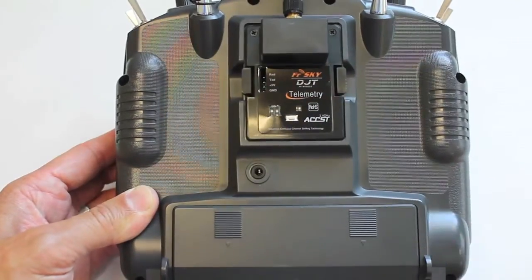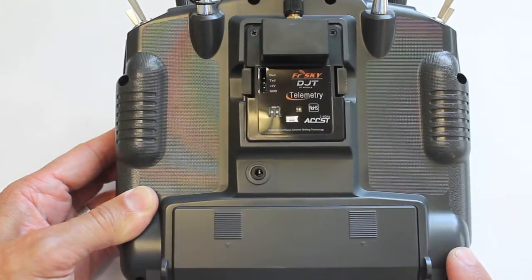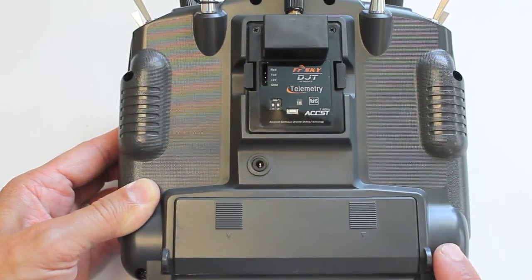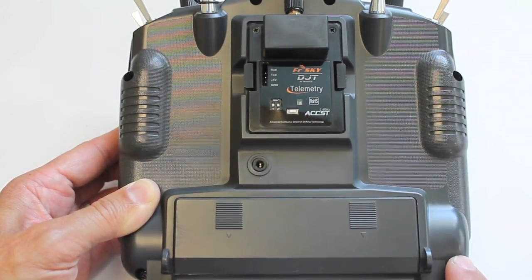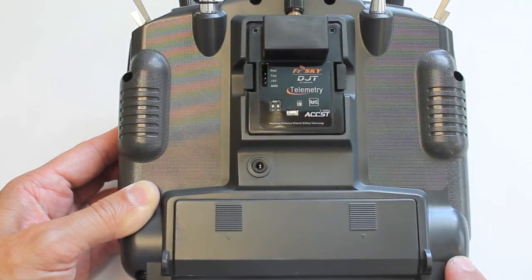Before I order, I want to determine what I'm up against, because if you have the generation 2 hardware you don't need to do any soldering, and if you have the generation 1 hardware then there's a little bit of soldering required. It can get pretty tight with some of these chips. So I'm going to walk you through the steps to determine whether or not you need to solder a pin for your Smarty Parts board.